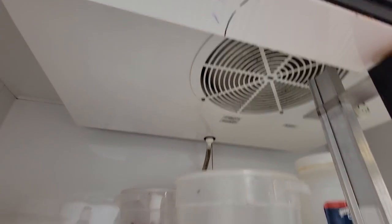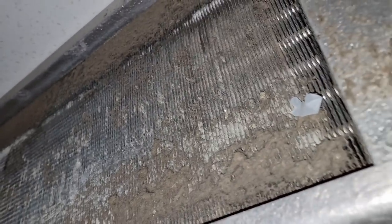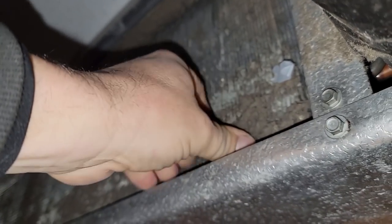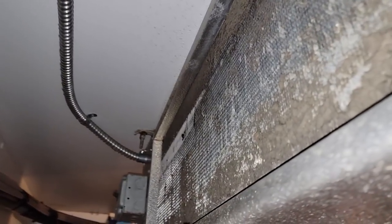No ice on the back, fans are running. Let's see what we've got down here. Filter medium looks fairly clean. The coil is a little dirty — seen worse, it can definitely be cleaned off. It's warm but we can always come back and do a cleaning on this thing. I think our biggest problem with this one is going to be that it's low on charge.